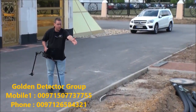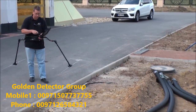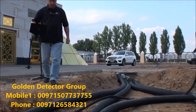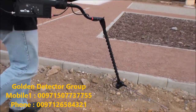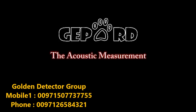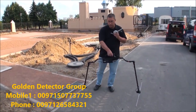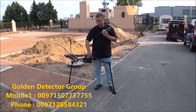I'm going to do a short scan of this here — we have a freshly buried water tank. To start the scan, push the multi-function button one time. The light will blink. Hold the unit comfortably in your hand, push it forward. It is blinking and I can see the signal coming in on the screen. I hold it as steady as possible over the object. When done, push the button and the scan will stop. I've turned on the headphones — as I approach this metal plate, you can hear the difference and the break in the signal.